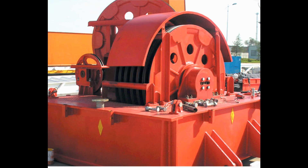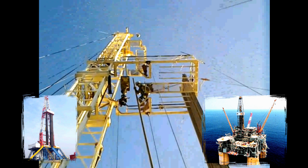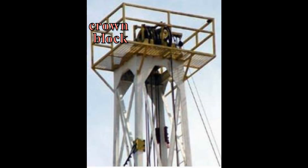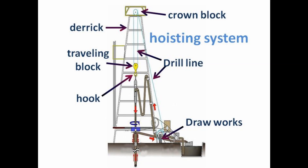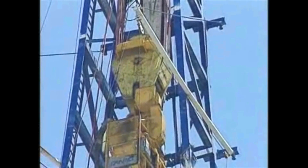The number of these pulleys is dependent on the needs of the drilling program. For example, deep wells require more pulleys than shallow wells because of the weight from the extra drill pipe. From the crown block, these multiple strands of steel wire are attached to the traveling block. Together, the fixed crown block and the moving or traveling block give tremendous mechanical advantage for hoisting very large loads from the hook, which is located below the traveling block. With these five components, the hoisting system can raise and lower the drill bit and its string in and out of the hole.